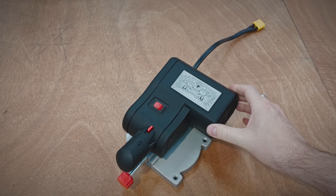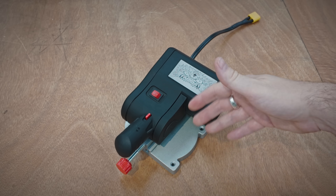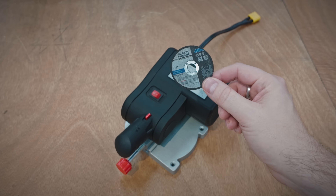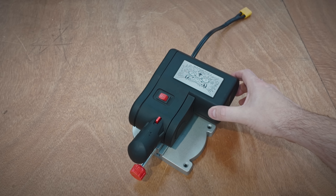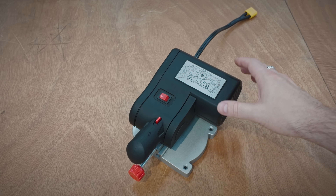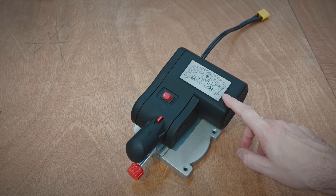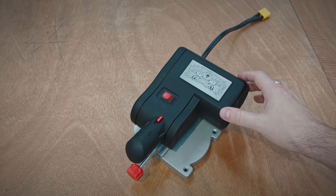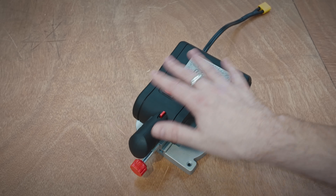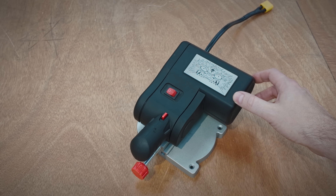Really, all we need to do is rip out the original motor and replace it with one that spins faster and is more powerful, and then use these abrasive cutoff discs. And that's exactly what I've done with the Mini Monster. It now spins at 25,000 RPM, which is right in the range of those cutoff discs, and it's a tad bit more powerful. The stock motor was about 60 to 80 watts, and we're now up to around 700 watts, or just under one horsepower, assuming you can provide it with enough load. Let's take a look inside.